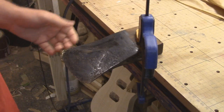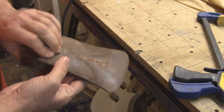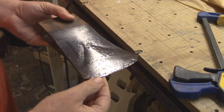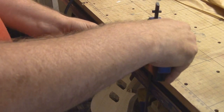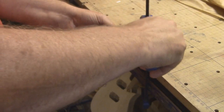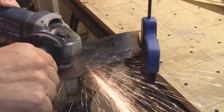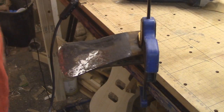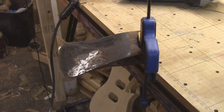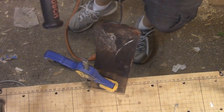Man, there is some pretty serious pitting in this thing. The question is, do I want to try to take that pitting out and reshape this to make it look new or not? If I do, I'm going to have to use a different type of grinding wheel, because the one I'm using now is kind of just knocking off some of the surface stuff. It seems like if I want to take out these pits, I'm going to have to get artistic and remove a little bit more metal than I really wanted to. Some of these pits are just so deep it's going to look really funny if I don't remove them. So I'm going to try to reshape it — what the hell. It's not the ideal disc but I might as well use what I've got.